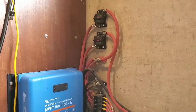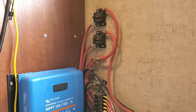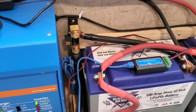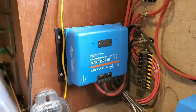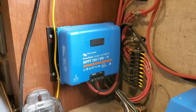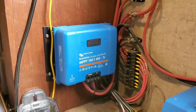I used these two resettable circuit breakers so I can simply push a button and disconnect my entire solar array from the charge controller or the batteries. I also installed a 400-amp fuse with a shunt to isolate the batteries from the inverter. This way, everything is protected from the solar array to the inverter. This is the solar charge controller — it's a Victron MPPT 150-volt, 100-amp charge controller with Bluetooth. I'll be putting the links to the Victron MPPT appliances in the comments below.